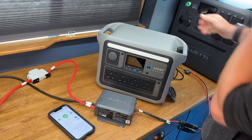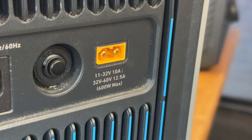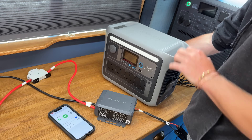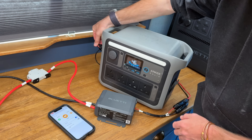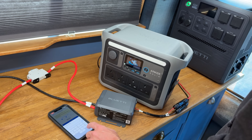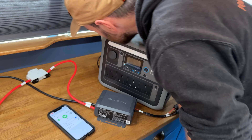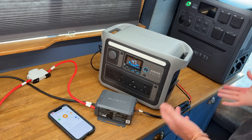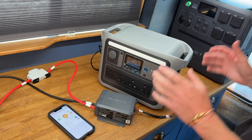Next power station is an Anker C1000, also an XT60 connector. It accepts 11 to 30 volts at 10 amps, or 32 to 60 volts at 12.5 amps. Since we're still at 28 volts, we can plug it in — currently doing 270 watts. Let's unplug that, change to custom, go to 56 volts maximum, which is within the range of the port. Wait 90 seconds, then plug in. We should get the full 560 watts charging and — there we go — we're actually getting 589 watts. That should work with the vast majority of power stations which take PV or solar in, as long as you have the right connector and set the output within the range of the device.